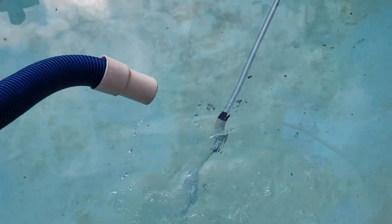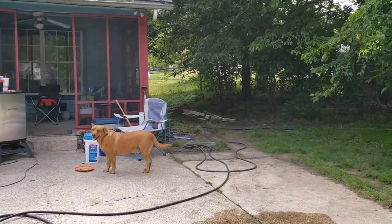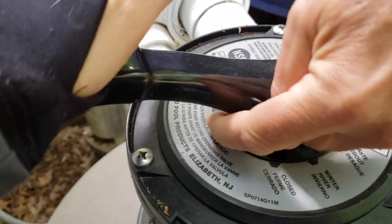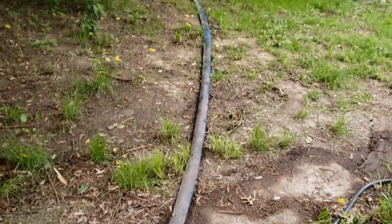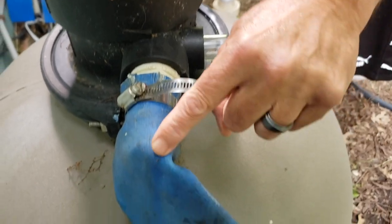Put all the attachments back in a place where you're going to find them. Pull the hose out, remove all the water, wrap the hose back up, and set it back in its place on the outside of the house so you know where it is for next time. What you want to do weekly is backwashing. If there's a bunch of nasty stuff going on in the pool, you want to get rid of it. Shut the pump off and make sure it stops running, because you can really damage the material if you don't turn it off. Then move the handle all the way around from filter to backwash. It'll come out of the blue hose with either black or gray water, and you want to run it until it's clear — generally that's about three minutes. Backwash diverts the pipe water through the sand filter and out the blue discharge hose to clean your sand.